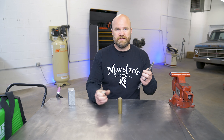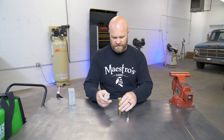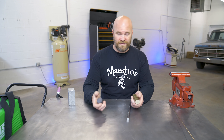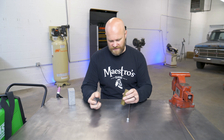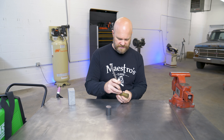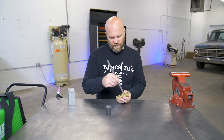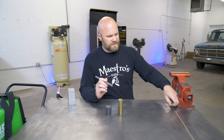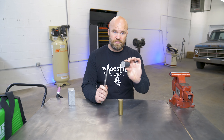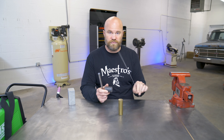Here's all of our little pieces. This is one of those projects you just kind of make do with what you have. I'm lucky enough to have the horizontal bandsaw to help cut these pieces out, but I do not have a drill press and I do not have a lathe — a lathe could really make some nice looking parts. A drill press would help us with what we're about to do, which is drill the 9/16 hole into here so we can set this in a little bit. Then we're actually going to weld or fuse that on there with some Blue Demon silicon bronze. And then we are going to drill a 9/16 hole all the way through our counterweight, which is going to slide over the shaft, and weld that on with some Blue Demon ER312.